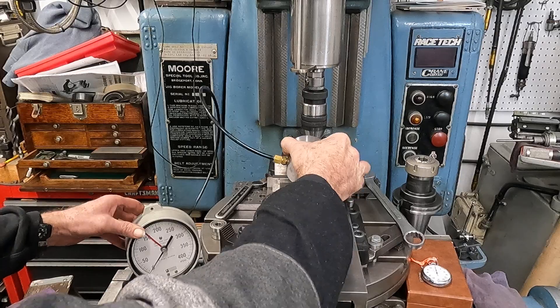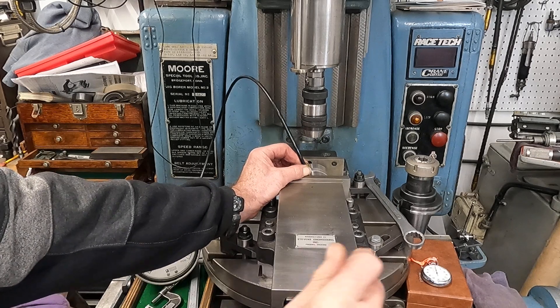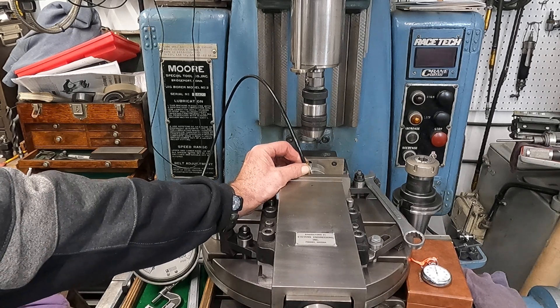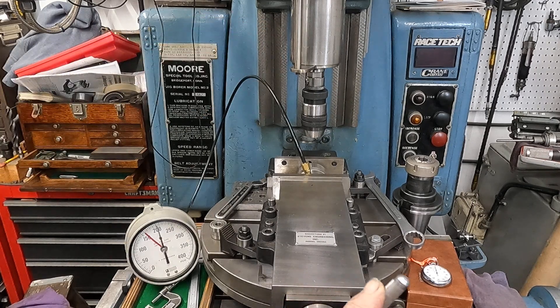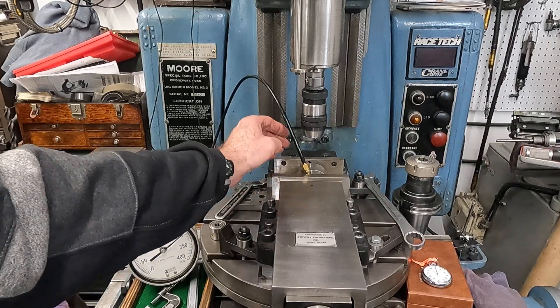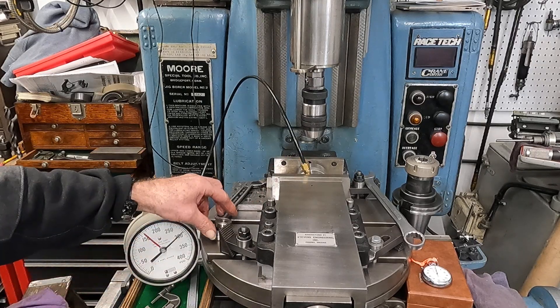I'm going to put the ram into the Stevens torque-limiting vice — you can examine this too. What you have to do: you see that gauge — you're going to have to put a load on those bearings at 250 pounds for the nose pair of bearings. You won't use this vice; you'll put the ram in an arbor press and take the bearings.